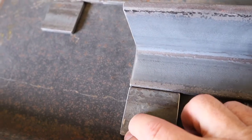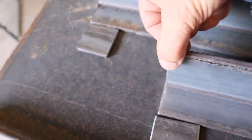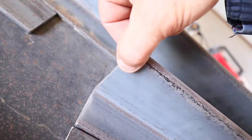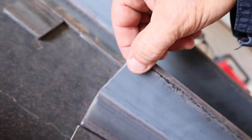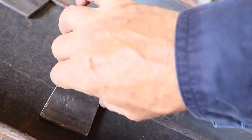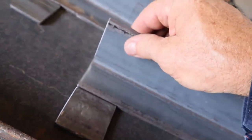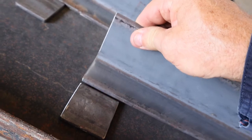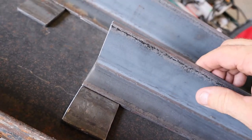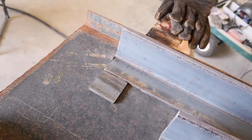What I'm worried about is torque, in that the pulley's going to be attached here. It's about 2 1/2 inches. And it's going to be wanting to pull this way. So just to counteract that, I'm extending this little part. Put a bolt here and a bolt here, and that'll keep it from wanting to twist, if at all. Maybe I don't have to worry about it at all, but oh, why not? So I'll do that to both of these.